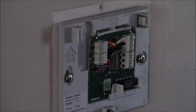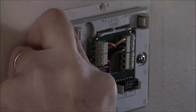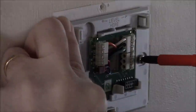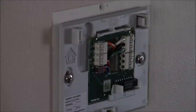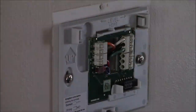I have turned off my breakers for the air conditioning and furnace. Now I'm leveling it up and mounting the faceplate to the wall. I'm right into the stud on this one, so I used the pre-existing hole without a plug — it seems to be holding fine. If it later goes wonky, I'll put a plug in. Let's just check it's level again — yep, it's good and level. Now I'm going to go downstairs and hook up the C wire.